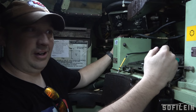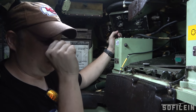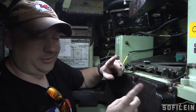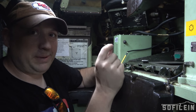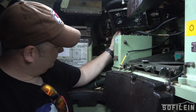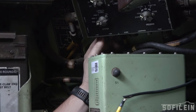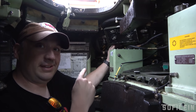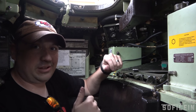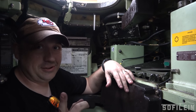Now, for all you guys that don't know, if you want to hear your iPod shuffle through your headset, this is how you do it. You take an old set of headphones that you don't want anymore, right? Wired up headphones. You can't use your cool Beats ones for this. Take the earbud part, cut it off. You're gonna take those wires off of the earbuds, you strip them down to copper, right? Roll them up a couple times so you got a fat wad of copper. Then you take these little turn knobs here and you rotate them all the way. And all those are little pinch knobs to stick wire into. You see where I'm going with this? You take the ball of copper, you shove it in each one, you put one on one side, one on the other. Then you take that 3.5 millimeter headphone jack, stick it in your little iPod shuffle, boom. You've got your own internal stereo going on that only you're the DJ for, so everybody in the crew has to deal with you.